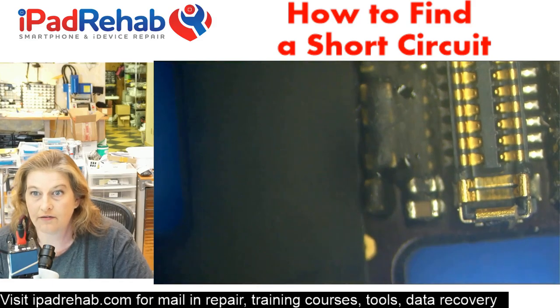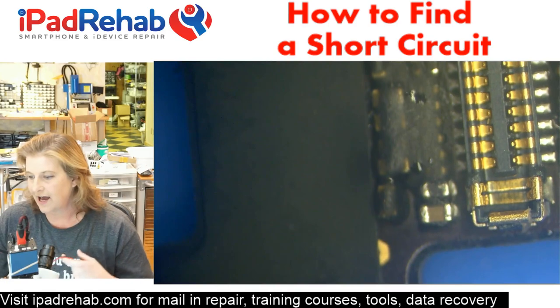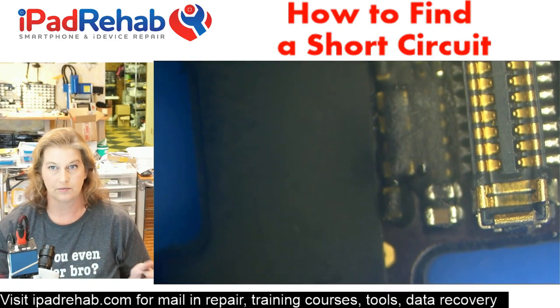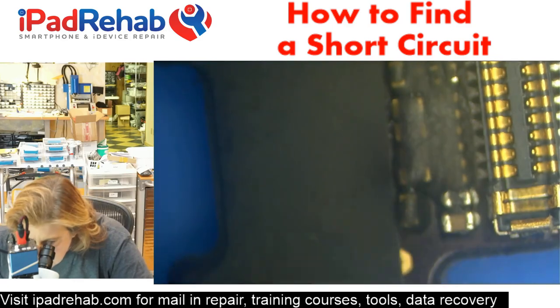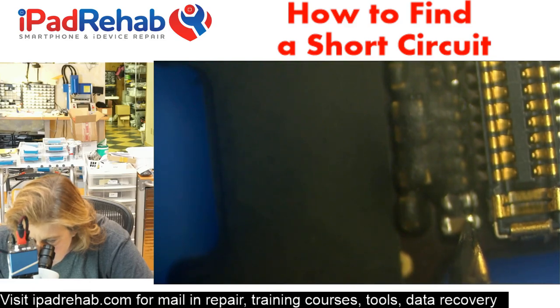All right, so here's our 1V8 touch line cap. Let's ask it, hey bro, are you short, yes or no? So we're going to take a diode mode measurement, and we're going to go red probe on ground, and we're going to touch both sides of this cap. One side reads 000, and the other side 000.